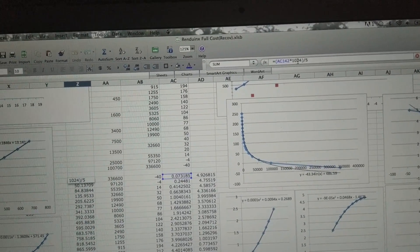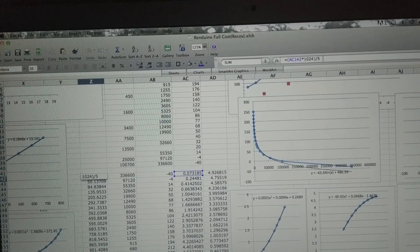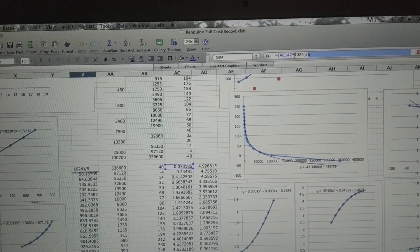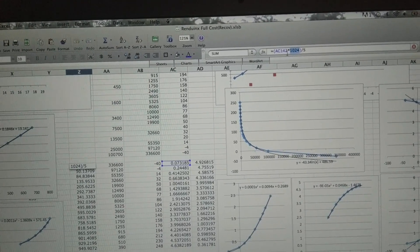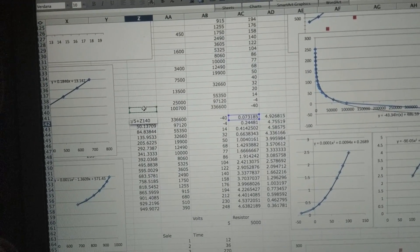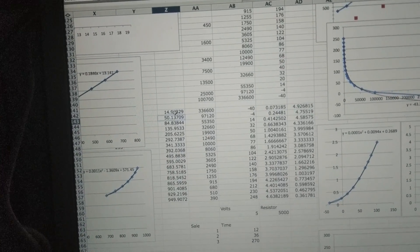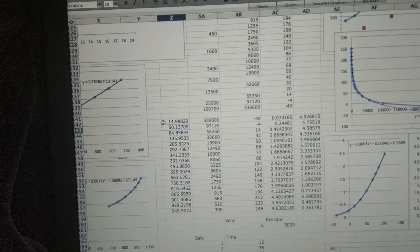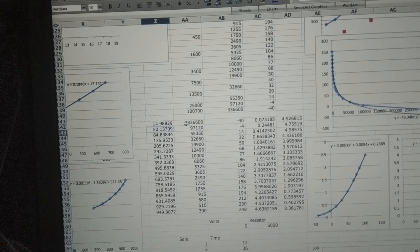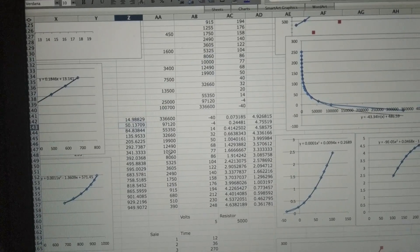You take your number and multiply it by the scale that you want, then divide it by the scale that you have. For instance, we have a 5-volt scale but we want to go to 1024 as our max - multiply by what you want, divide by what you have. This is what the reading would actually be on the Arduino. So if we got 15, we would know that it would be negative 40. It's just another conversion step.